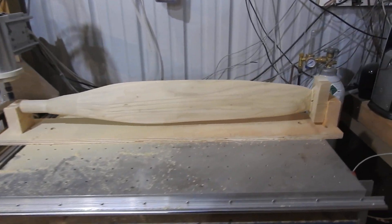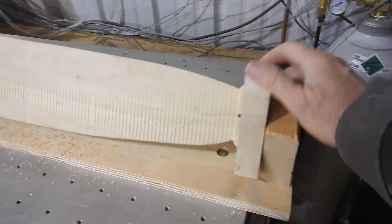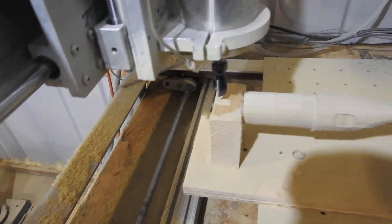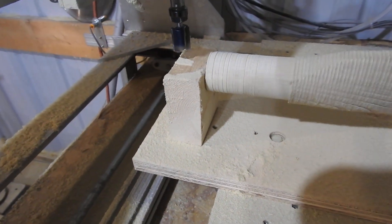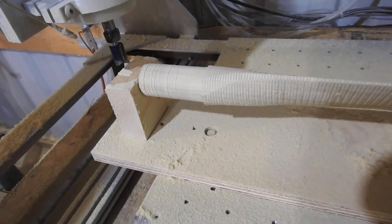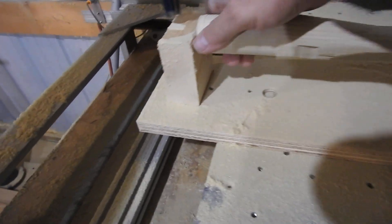What you can see here is I mounted the prop in a little wooden jig so I could turn it down. I put the cutter bit back in, brought it over, dropped it down into the material and just spun it until I got the whole thing round. So that's as far as it needs to go.